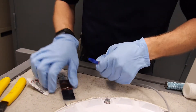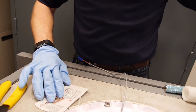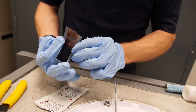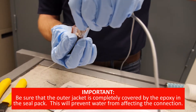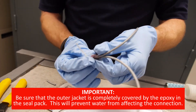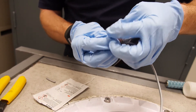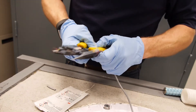Once we've got it zip tied and our epoxy mixed, we're going to push it all down to one side. We're going to cut off just the end of this so we can insert our wires. Split that open so we can fit them both in there. Once you get it all pushed back you can take your other zip tie. Make sure to zip tie this real tight so we don't get a bunch of goop inside the interstice of our bucket, and this connection stays watertight.